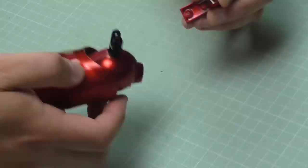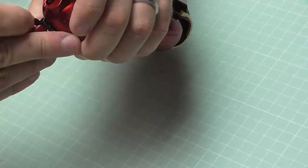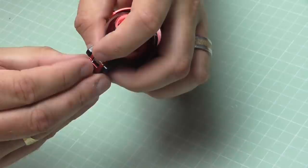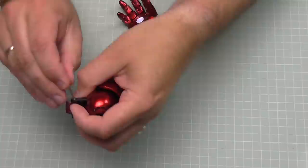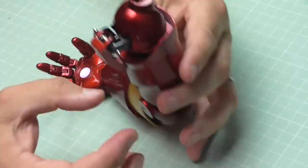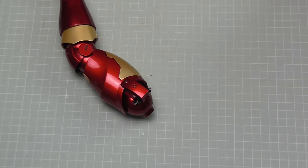The other end of the spring fits into a notch - do you remember this from the last stage? You can see a notch just on the side there. So when this section is in place, it fits into that notch. The long end goes onto the notch and the hook end goes onto the side of this section. We've then got a pin to keep all of that together - just put the pin through this side, make sure it goes through the spring, and all the way through. Now it's spring-loaded, so as you can see when I do this it snaps back. That fiddly little section is all there is to do in stage 13.